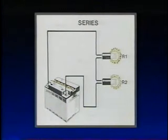The two types of circuits you will commonly be dealing with are series and parallel circuits. Electrical current must have a complete path to flow through from its starting point, through the loads, and back to the starting point. In a simple series circuit, current starts at the positive terminal, flows through the first light bulb, through the second light bulb, and returns to the battery negative terminal. If either bulb fails, the remaining bulb cannot light because we no longer have a complete circuit.